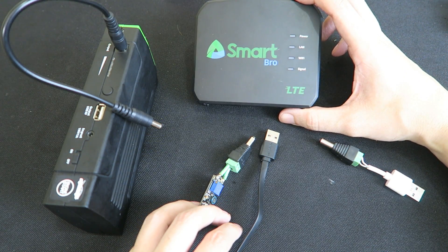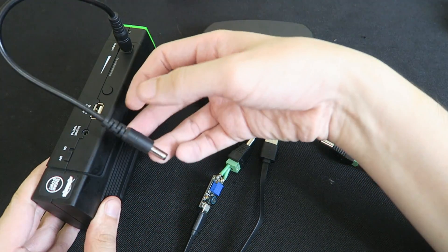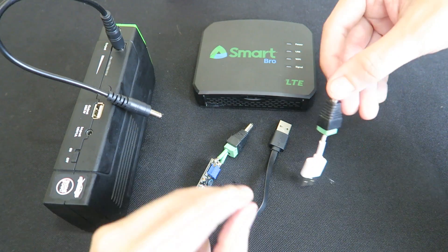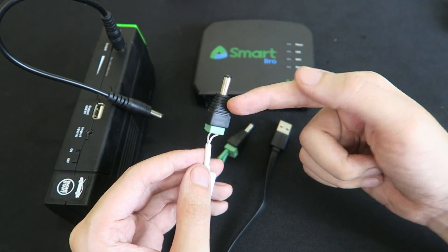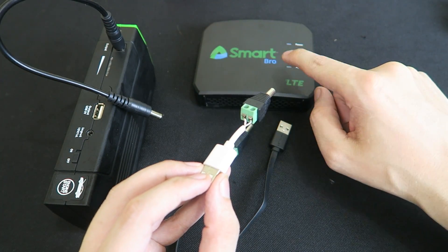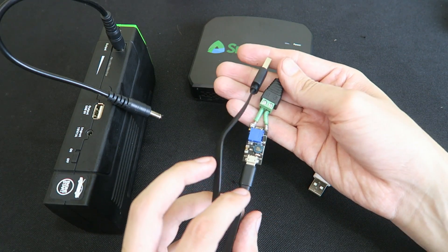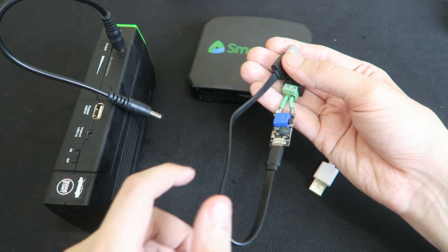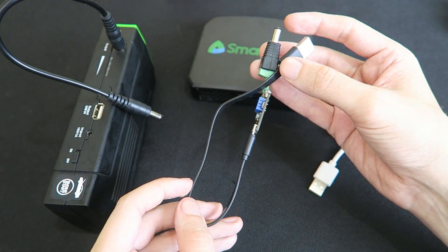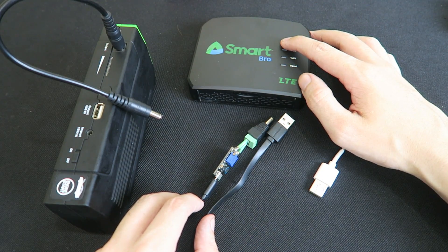So that was a quick video showing you three ways to make this into a portable unit. The easiest and most reliable is to use one of these jumpstart power banks with a 12-volt output — that will work absolutely the best and it's the simplest to set up. The next easiest way is just a regular USB cable going into a DC jack; it did work quite well, but under heavy load for a long time it might reboot — it's fine for light to medium use. This solution with the voltage booster can actually be just as reliable as the jumpstart kit, but you have to make sure you buy one rated at least 7 watts or higher, otherwise you'll run into problems. If you have any questions put them in the comment section below, and if you enjoyed this video please give it a thumbs up and subscribe. Thanks for watching.